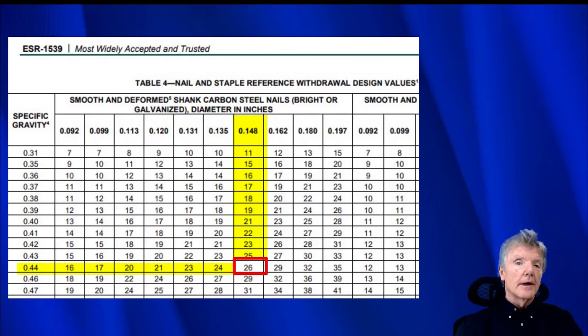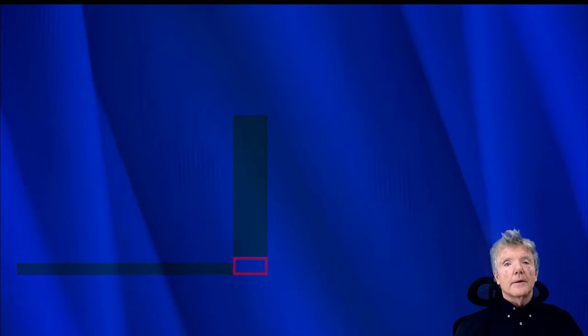We only have 2 feet of crawl space. Maybe you're on your belly or really cramped, and you're supposed to get a hammer and a bar out and try to pull it out. The incentive to leave it there is pretty big. So you'll either switch to thinner nails for all your future nails, or you'll just go ahead and leave it there, and you might leave a whole bunch of them there, because you know that they don't all split when you shoot them with a nail gun, but enough of them do to make it a problem.